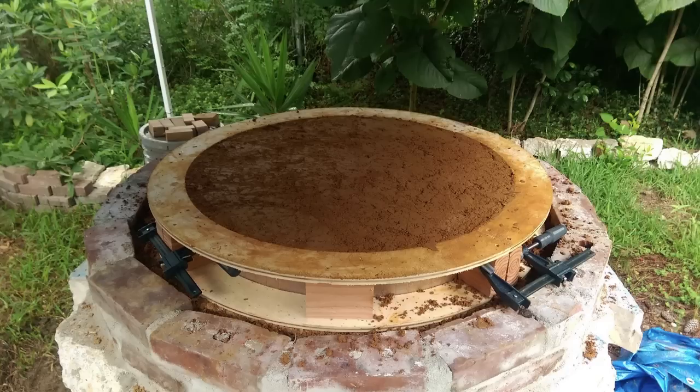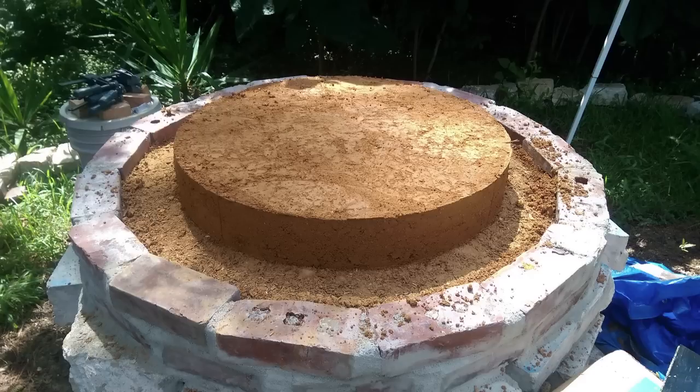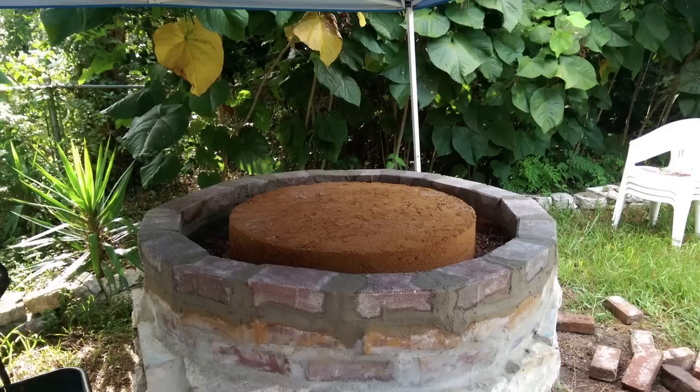After removing the mold, you can see the trough and even a little bit of the bottles poking out. The moat was almost up to that second layer of bricks, so the next thing was to add a third layer of bricks. Now we've really got a moat that's going to contain more bottles and more insulation mixture. Since I had this circular moat about the diameter of a bottle, my plan was always to fill it with upright bottles.